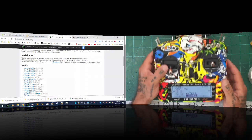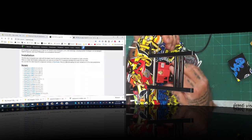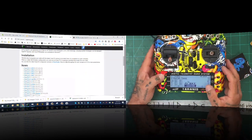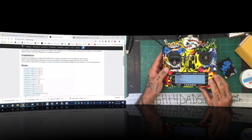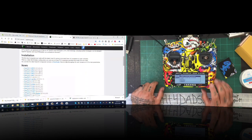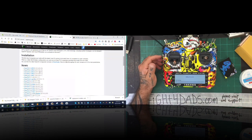Now it's time to set up our receiver and module. Let's power it off, flip up the stand, take out the back plate, and carefully insert the R9M module — I'm not going to worry about putting the antenna on right now. Turn it on — welcome to OpenTX. Hit the menu button, hold it, press page, go to firmware, go to FrSky firmware, then R9M R9M Light folder, and go ahead to update R9M FCC. Hold that down and make sure you select flash external module — NOT internal. If you flash internal you'll probably break the system. Flash external.